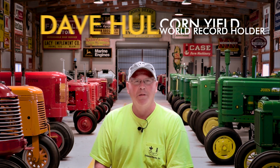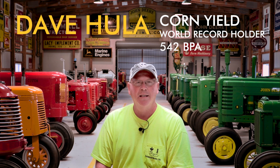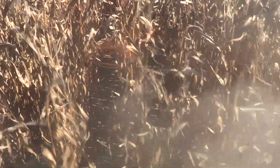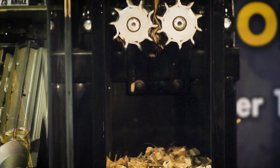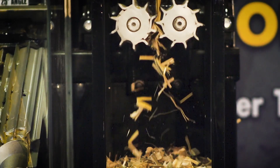We've come a long way in corn management. We run John Deere corn heads, and when we first started we had just a regular fluted roll corn head. That was crimping the corn and pulling the ear off as the ear hit the deck plate, and we were living with it. Well, this year we've transitioned to the Calmer knife rolls — I think they're the 12-blade Calmer knife rolls — and they're breaking residue up into real small pieces.